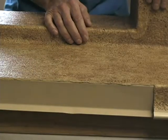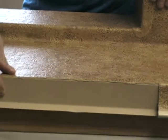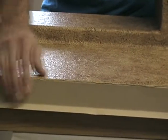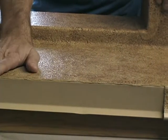You have several choices when it comes to your choice of drip edge. A nice colored piece of coated drip edge like this one allows you to weld the membrane straight to the top of it, gives you a great adhesion to it and a nice look.